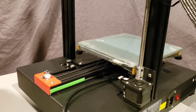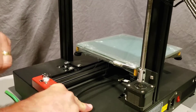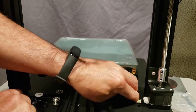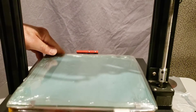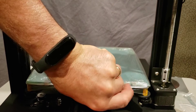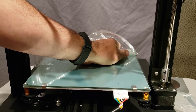Z is back here in the back. There is one of these green ones back here too — I'll pop it out. Because we slid that bed forward, it's super easy to slide in. I like to push this cable as far down so it's one less thing that can run in the way. Slide this back, reach in front and pull off the tape that was holding the heated bed in place, pull the heated bed cord back, pull off the protective covering, and boom — hotbed is attached.